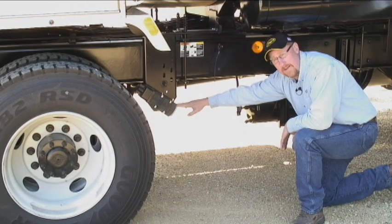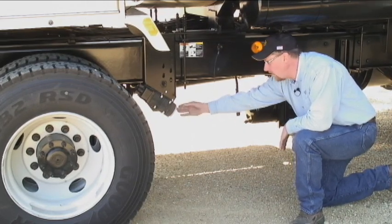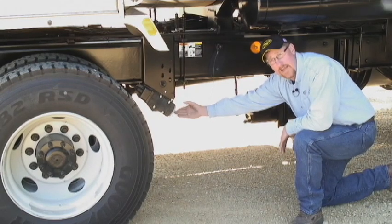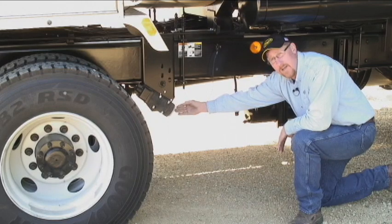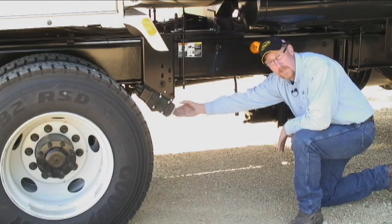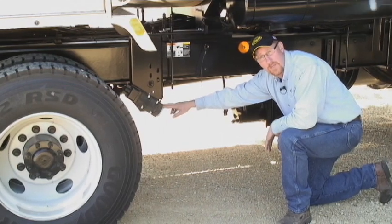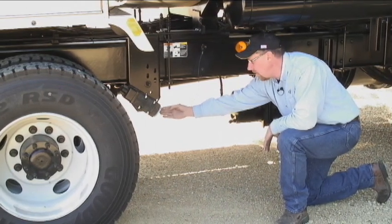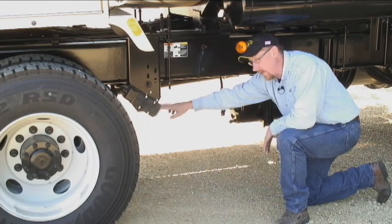It has a white lens on it, which may in time get some asphalt overspray on it, so you do need to make sure this stays fairly clean. A little bit of overspray won't hurt anything. It is plastic, so using some diesel fuel on it to clean it is fine. Please try to stay away from citrus orange cleaners — I've seen where they tend to bubble this lens and melt the plastic, which will give you a false reading.